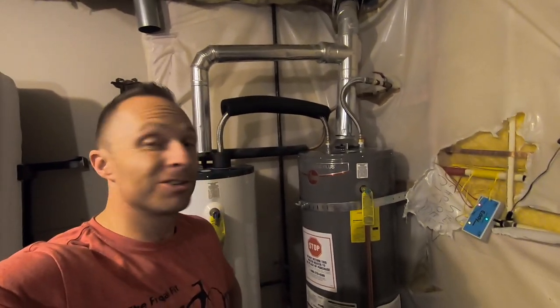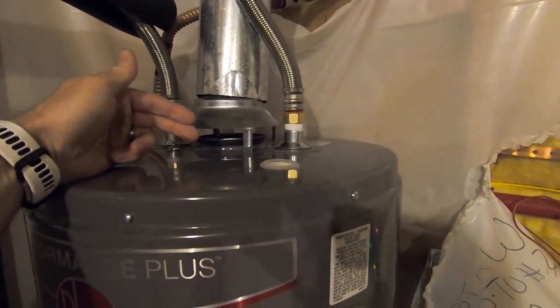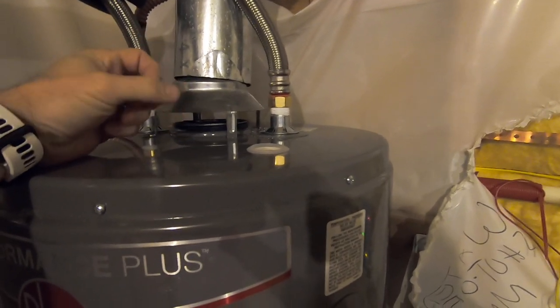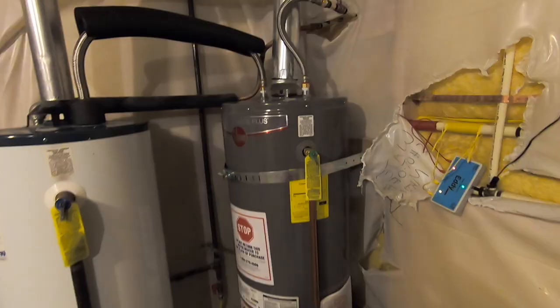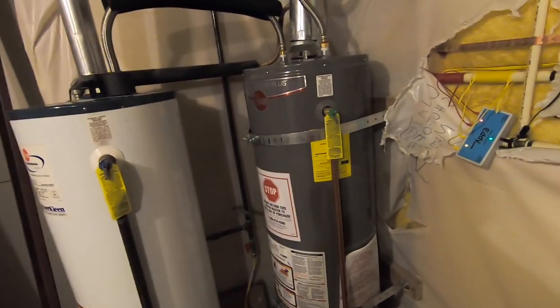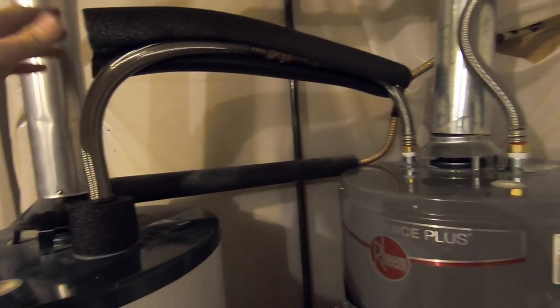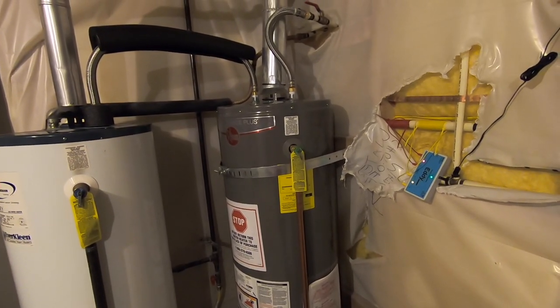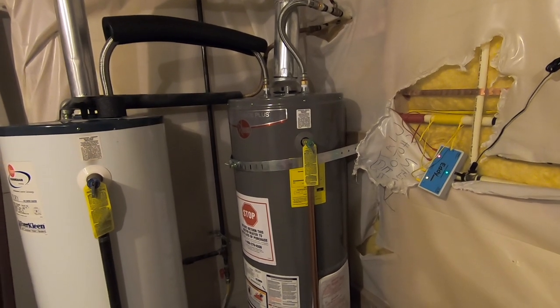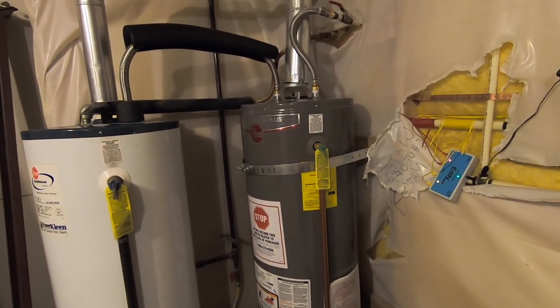It's been about a day and so far, so good — the hot water is rocking and rolling and I'm absolutely stoked to have saved $900. We tested the flue by lighting a match, blowing it out near the flue opening, and confirmed the smoke was drawing really nicely. We did replace a 50-gallon hot water heater with a 40-gallon, so now we have two 40-gallon units — which should be sufficient. We ended up using two hoses to connect the two heaters together. Total cost came in around $550 to $575, instead of the $1,500 it would have cost to have it replaced professionally. Thanks for watching!